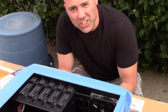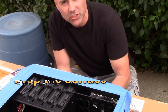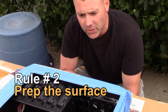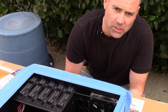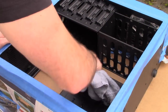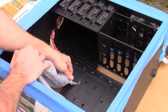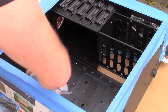The first two rules actually go hand in hand, and the next one is to prep the surface. Make sure that your surface is ready for paint. You can prep the surface first and then mask, or you can mask and then prep the surface — whichever is easiest; they're pretty interchangeable. A cloth works great to get dust out, especially on projects like this. Just make sure that your project is completely dry before you go to the next step.